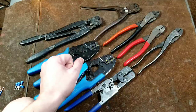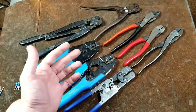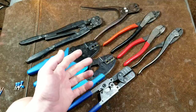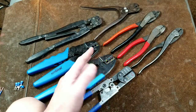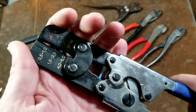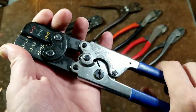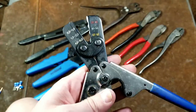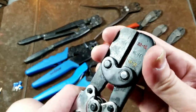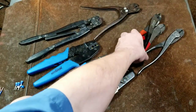When you really want to do high quality wire crimps and don't want to squeeze super hard — perhaps because you're putting a terminal on solid wire or using a high quality terminal like KS which uses thicker metal requiring more force — the issue with standard plate steel crimpers is it's difficult to crimp the connector tightly enough to provide a proper hold on the wire. Sometimes you over-crimp worrying about it. The advantage of ratcheting ones is they're all properly sized with proper dies. The compound bolt cutter style ones are super heavy duty for solid wire where you need a lot of force in a compact crimper.